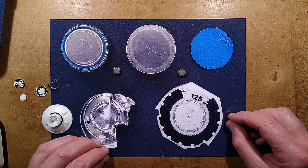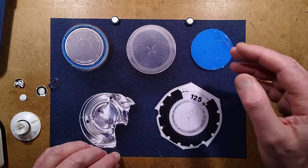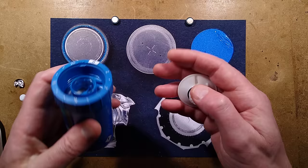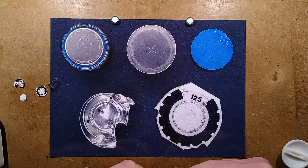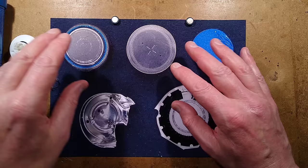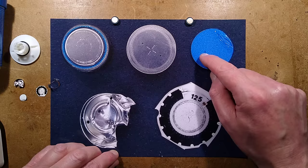One of the most safe and inert batteries available. Nobody will need to salvage the batteries out of these before disposal — it's very inert materials. So what they're doing here is they have two zinc air batteries with their seals still intact. By the time it's sealed into this unit, with its little O-ring to stop gas escaping, the only way the gas can get out is to displace the grease out by pushing that plunger down. Any oxygen that might penetrate in isn't going to really have much effect. Because the batteries are bridged and because of that low base voltage, it must just be creating gas out of the chemistry inside, venting out the holes that would normally let air in — and that is what liberates the gas.